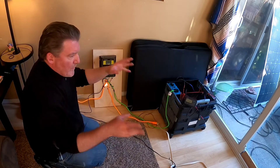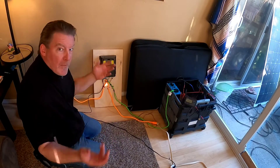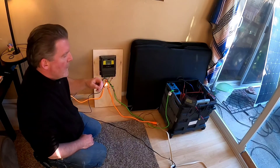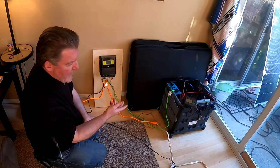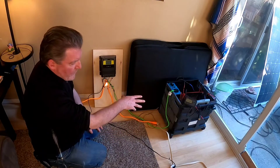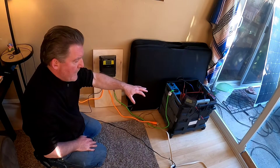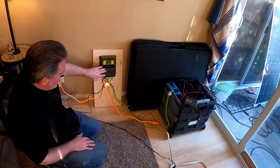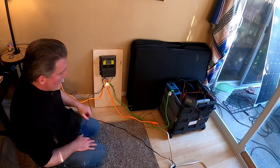The thinking is that the solar panels produce more than enough electricity in full sunlight to power my entire living room and charge the battery at the same time. So the battery charges through the day even if I'm watching television. When the sun goes down and the solar panels stop producing, it'll automatically draw directly from the batteries alone. And when the batteries drop to a certain threshold, it'll automatically switch over to grid power through this unit here.